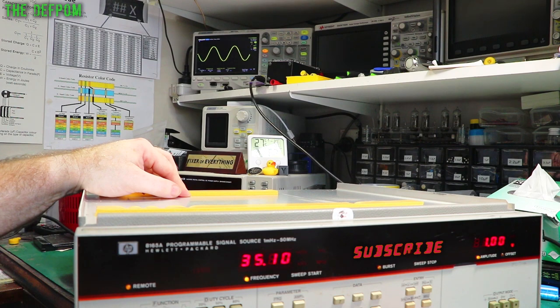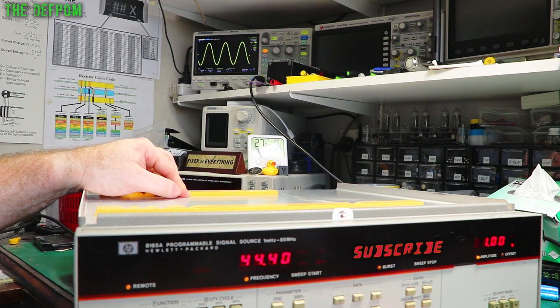35 megahertz is 2.1 volts. And now it's dipping down again. So it's probably a linearity thing there. And at 50 megahertz, we're getting 2.5 volts. So its peak is about there. It's about 3.1 volts. So it's quite a big difference there, so that's something I'd probably have to look into.